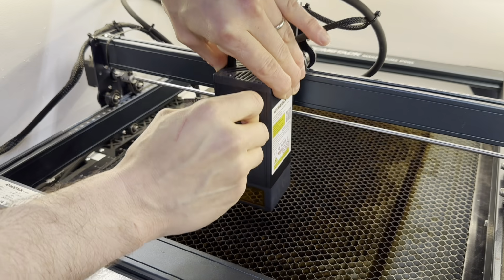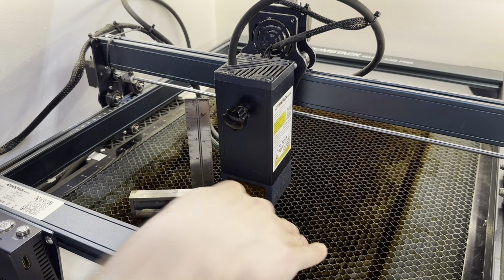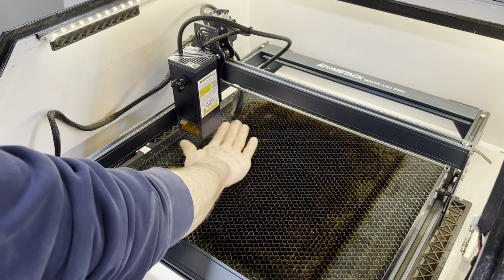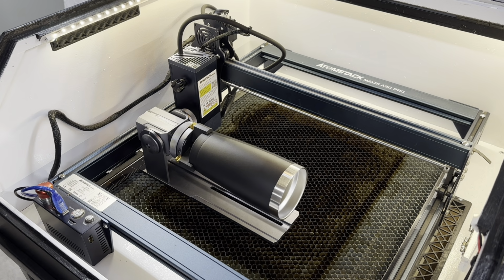Next, I tested the full travel of the lift with all the stuff installed in the lower cabinet. Here you can see you really only get about an inch of adjustment on the Z-axis with the cutting surface at its full height. Since I can lower the cutting surface, when I want to use the rotary engraver, all I have to do is this.